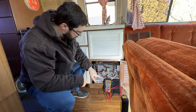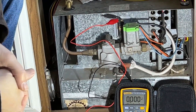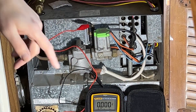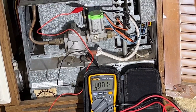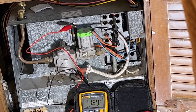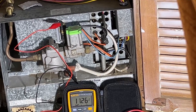I've got my multimeter set up, connected to the top of the limit switch and to ground. Right now I've got no voltage here, but when I turn on the thermostat and the fan comes on, it should take just a moment for the sail switch to close — and then I should see 12 volts through this piece of the circuit. And it did just take a moment — it's at 11.25 volts, which is close enough. It should be working well, except I have a wire disconnected right now.